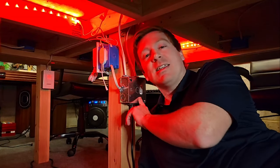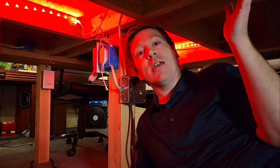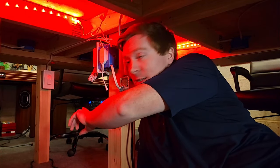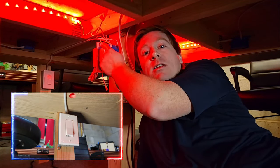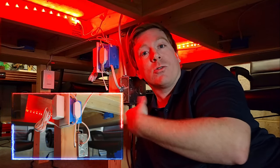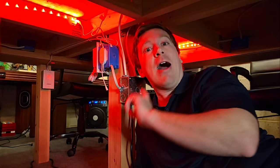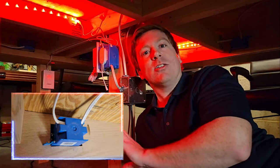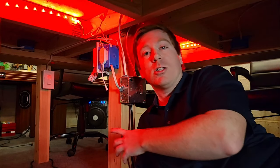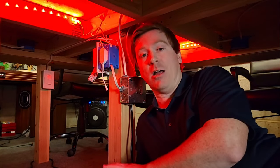Back to the junction box — I have this hardwired to a regular cable, the other end of which is just a plug that goes right into the wall, supplying power to the entire table. Then I have this hardwired over to a switch near my side of the table, and that switch links right up to an outlet which controls the light. So if I turn the switch on, the lights come on; if I turn it off, they go off. I have constant power hardwired into all the other outlets, so people can still charge their devices even when the lights are off. One switch controls the lights, and no switch controls the outlets — if I want those unplugged, I have to physically unplug the table.